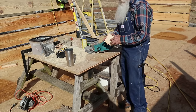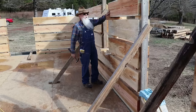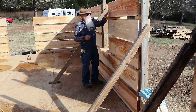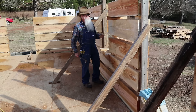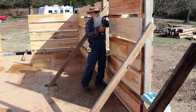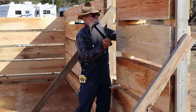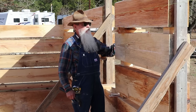Okay, we'll put this on top of our 2x4 block and see what we're doing on our line. Okay, here's how we've been raising these. Now this one is light enough to actually raise by hand, but I've got two wedges that are pretty thick, and we can just tap. I've got one on the inside and one on the outside, and I can just start tapping that up and bringing the one on the outside in at the same time. I still need to go about 1/4 inch.